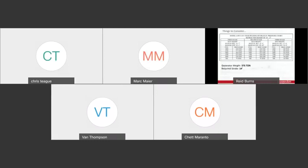And as you can see based on the chart, that reduces your overall capacity to 320 tons, which is less than the 375 tons that you're lifting. And so these are the type of issues that have got to be considered and addressed prior to showing up on site. In this hypothetical case, the solution to the problem may be as simple as cribbing the track up, or it may mean we bring in another set of gantries that have got a higher capacity at higher strokes.